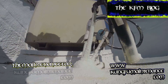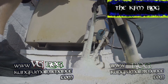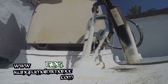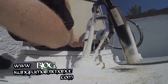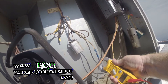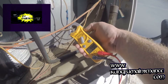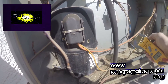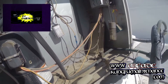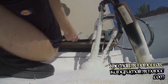I'm going to do this one here. I've got two more screws on it. Since I didn't have my data plate, I couldn't read any of these data plates. I'm going to clamp on only one wire. This one is only showing 9.5. You can see it's a different style compressor. I'll try it on the red run wire. Definitely a lot lower amp draw. I think that's what's causing our problem — that high amp draw drawing so many amps and overloading the circuit.